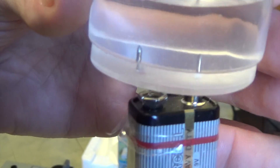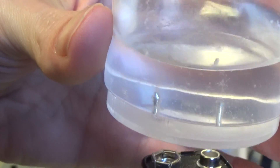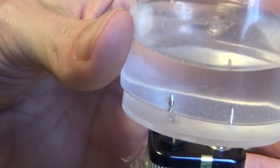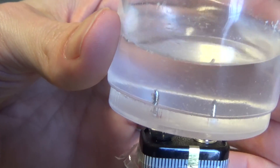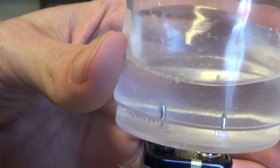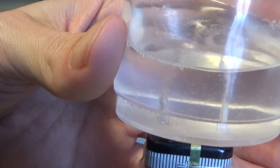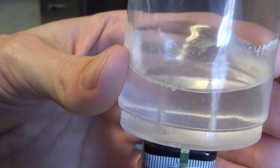Right now, just to show how explosive things are, I'm going to hook up a 9-volt battery to some electrolyte here. You can see little jets or streams coming up every time it touches — that's hydrogen gas and oxygen gas being produced. This is essentially what happens in your car battery when you're overcharging it. Remember, this is just a little 9-volt battery and some electrolytes. You can imagine the dangers with a 12-volt battery, so be extremely careful to keep sparks and shocks away.